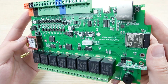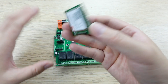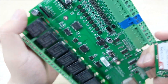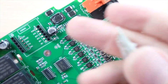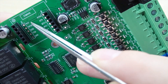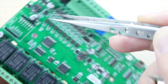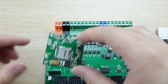If your country or city does not have 2G coverage, you can use another option. Here is the 4G or 3G SIM card option — the SIM7600 module, which supports 4G or 3G SIM cards. You just need to connect four lines: VCC, ground, RX, and TX. That makes it easy to use a 3G or 4G SIM card.